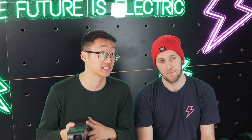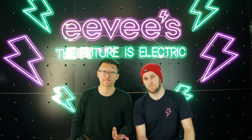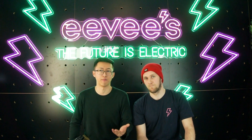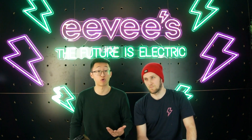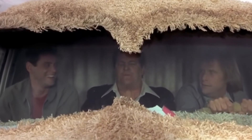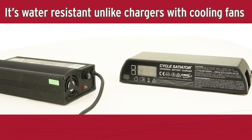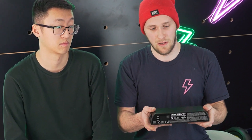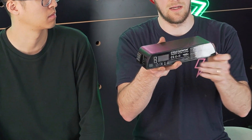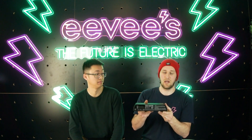It's also silent. A lot of the other chargers that come stock with a device have a very noisy fan, so if you're charging in your bedroom or living room that white noise can get annoying really fast. If you have a charger with a fan running and that fan goes bad, your charger is going to die because the components will burn out from heat. But this charger is designed to dissipate heat through the heat sink passively with no fan, so your charger is going to last a lot longer.